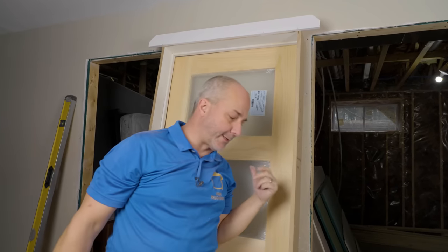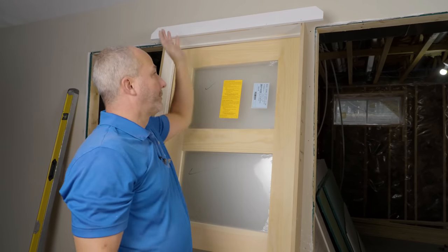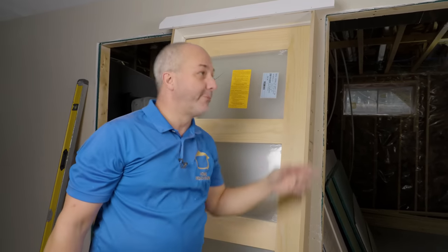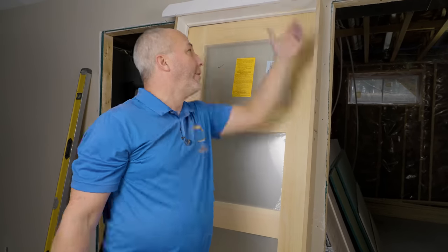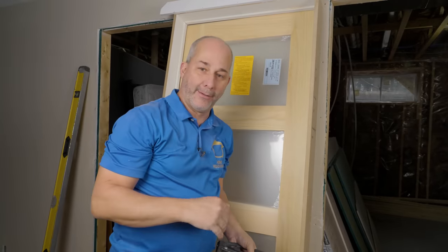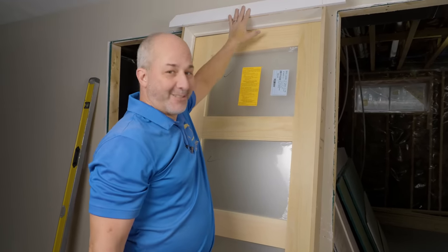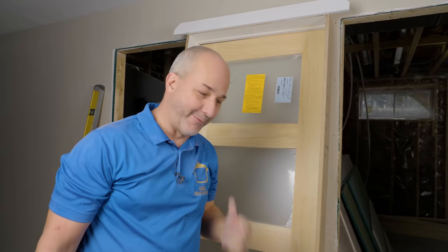Now I'm going to show you two different ways to case this. You can nail this in advance, which makes the door installation easy, or you can use an adhesive and nail it after just on the two corners — and that makes your repairs and your painting easier. So you've got to pick which difficulty you prefer. If you're a lousy painter, using adhesive and trimming it up might be better; but if you're lousy at carpentry, doing this to install your door might make your life a little easier.